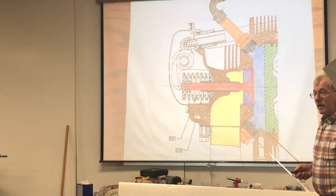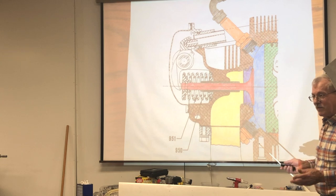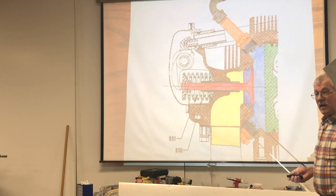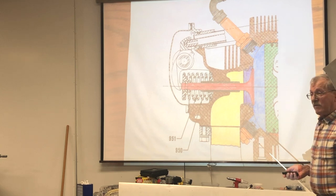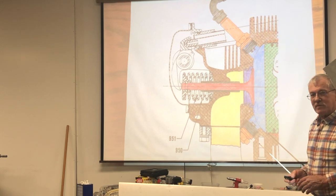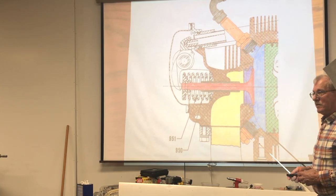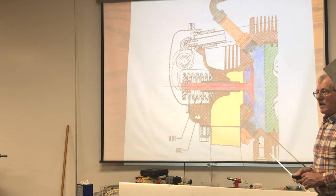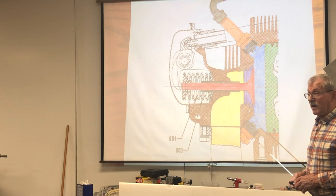Back when they had 80 octane gas, the lead content was so low and the compression of the little engines, 65, 75, 85 horsepower, 0-200s, was low enough that they would run on the 80 octane fuel just fine. However, back in the mid to late 70s, when the little airplanes that people were learning flying, like Cubs and Champs and Musketeers and Taylorcrafts and things like that, were starting to grow into the 152s and 172s and things like that, had higher compression engines. So the 80 octane gas started going away. Well, at that point, there was only 80 and 100 octane gasoline.